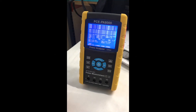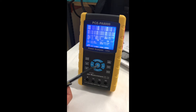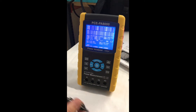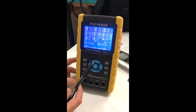As we get into the meter here, we've got a couple of buttons that are important to note. This is the power button for on-off — it takes about 20 seconds to initialize. This is the record button for data logging, and you can set that time up from 2 seconds to 7200 seconds. This exit button gets you back to the main screen. This hold button is for data hold. And this is your backlight button here.